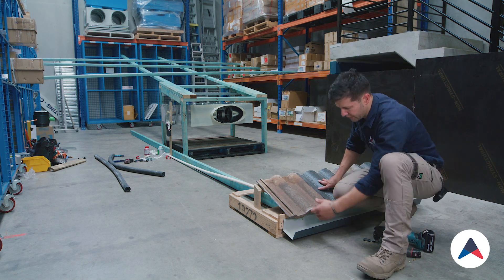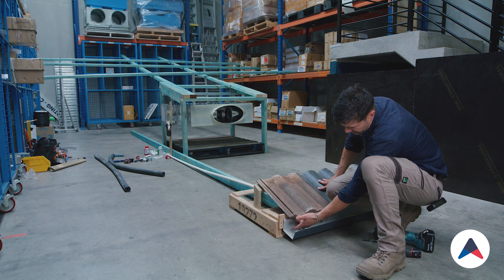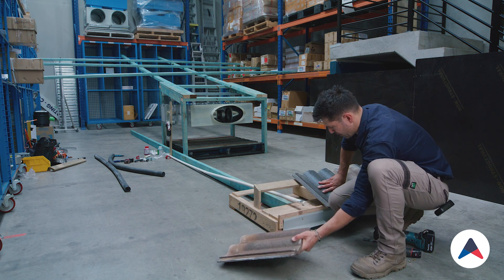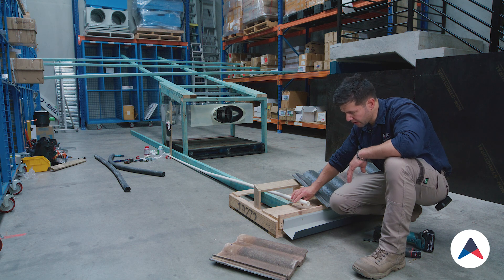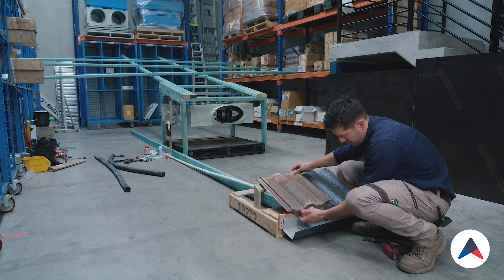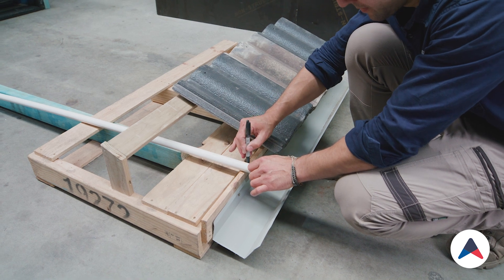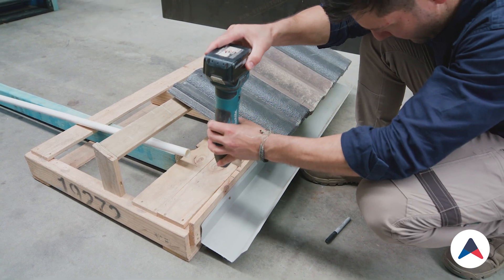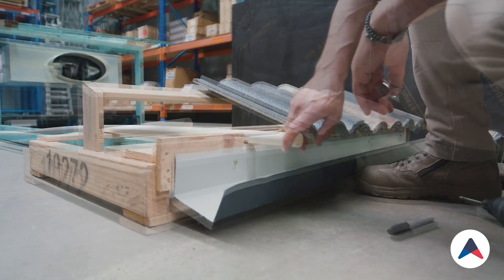What we're trying to do is bring the drain out through the part of the tile that steps up — that way it gives us a nice valley to fit the drain. If we position it somewhere flat, the tile is never going to sit back into place properly. So we'll remove that tile. Now that we're in position, we can notch out what we need. I'll just grab a marker to mark that position, then double check it's in the right spot. Looks pretty good. We've got this through.